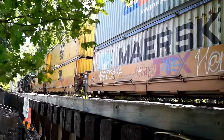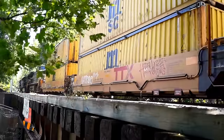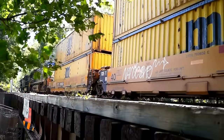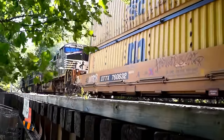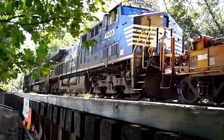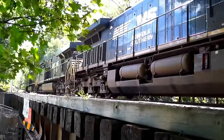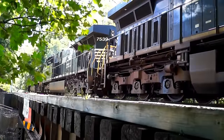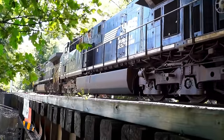I recall an article in Trains Magazine some years ago which mentioned the problems that KCS was having with mid-train power causing a bunch of derailments. At the time, the mid-train power was usually placed two-thirds of the way back from the front end, primarily to equalize brake response time. After another derailment, a mid-level manager crunched the numbers and developed a chart for the best positioning of mid-train power under a variety of circumstances.